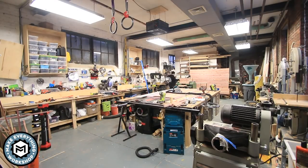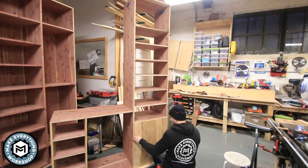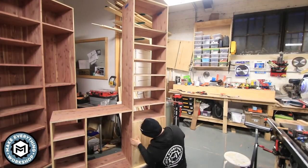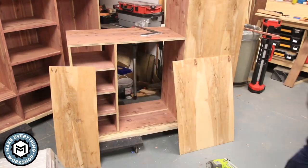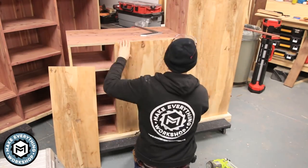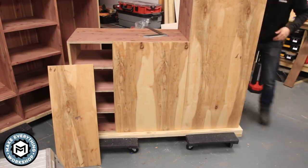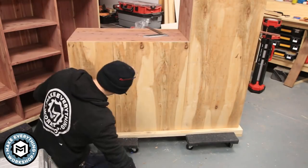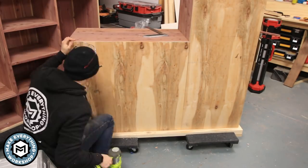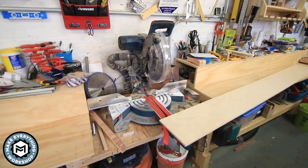Once that one's done I wheel the other section of the closet over and work on it. Since I already had the track saw set up I started with the back panel on this one. I make sure my back panels coincide with where the dividers are and how the whole closet is going to come apart, then I can do a little work on the nosings on that one.